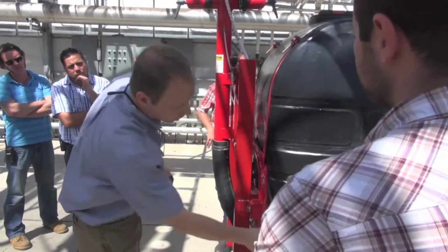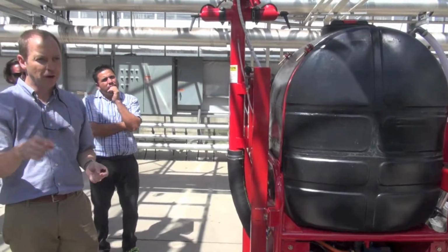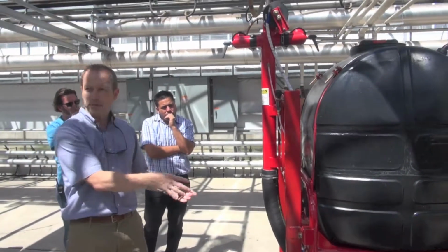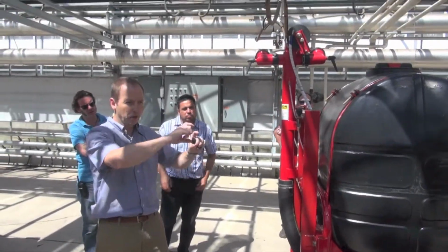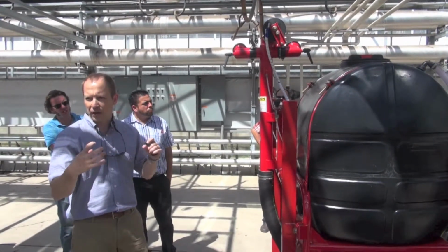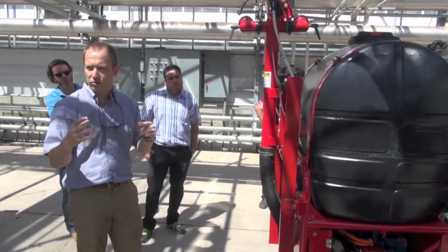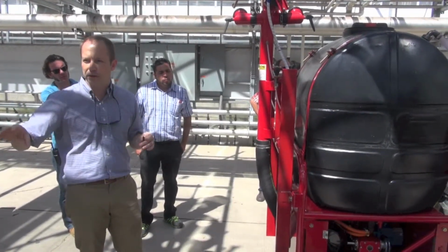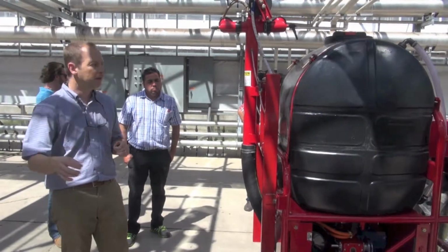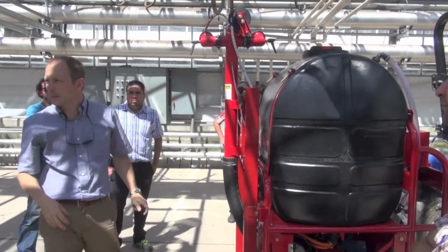These same things are also inside, and that's actually what's helping us make that bypass loop of only 80 PSI. The pump is operating at 350, but that little bypass loop there is restricted at one end and then less restricted at the other. So what happens is we drop the pressure and then we open it into a larger chamber and allow more flow out the other end, and that keeps us at 80 PSI, which is all we want at the nozzles. What's the advantage of changing the nozzle size?